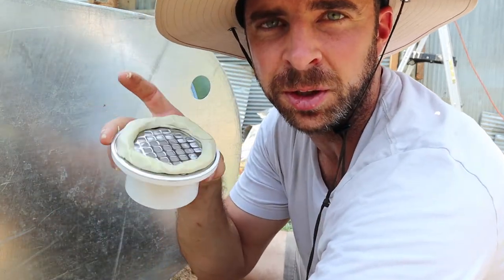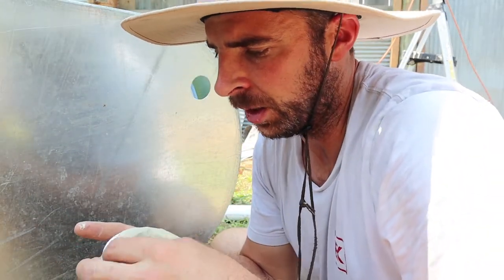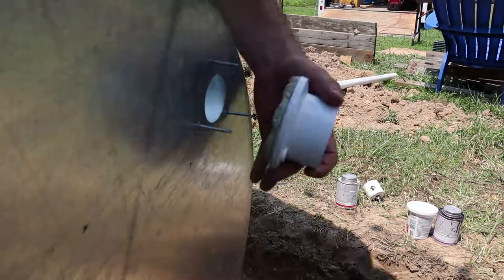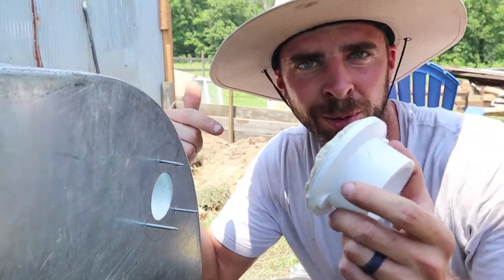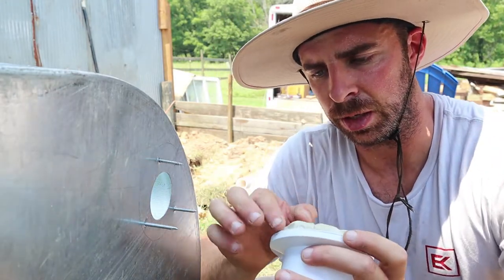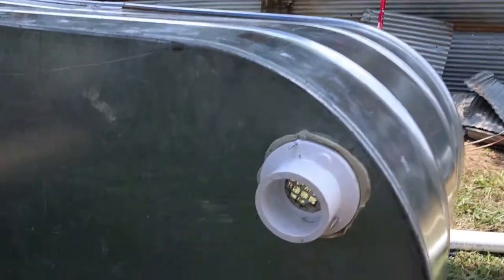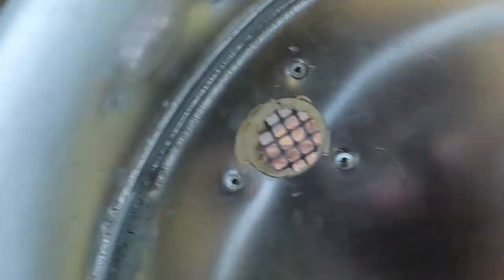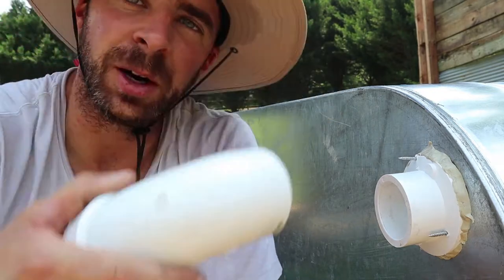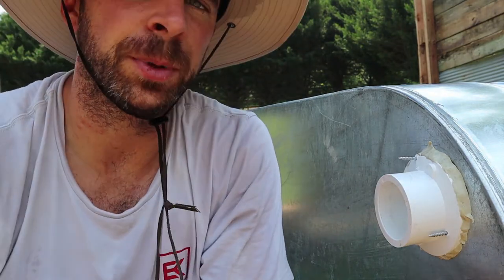If you're thinking I'm crazy for doing this — this is what's underneath your shower, your sink. This stuff is used a lot and it stays flexible over time. It really works very well. I was surprised the first time I used it that this is actually how plumbing stuff gets sealed. It's really difficult with one person to drill and hold everything, so I marked it and drilled with a drill bit then put it in. Here's the finished product — you can see all the putty that's squeezed out. That took a long time — I would recommend two people. Now I'm just going to start priming, gluing everything, and start putting in my drain pipe.